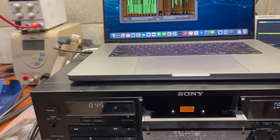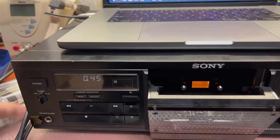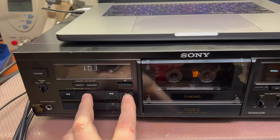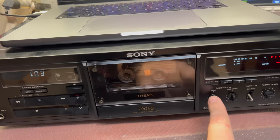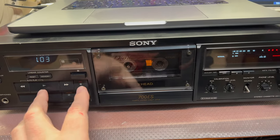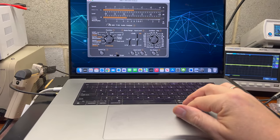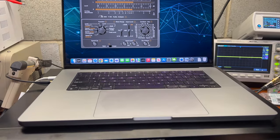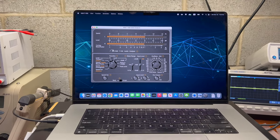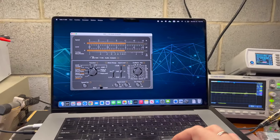Now let's see a recording. Let's put this tape. So I didn't adjust bias for this tape, didn't calibrate, there is no calibrator mode. But let's see what we will get there on the recording. Okay, so it's a level, source, tape. Okay, half decibel loss on the right channel. I was tuning using my VTVM, so it is pretty fine.